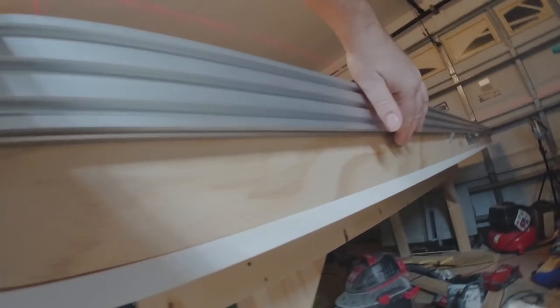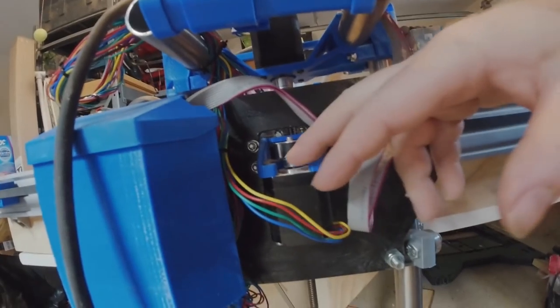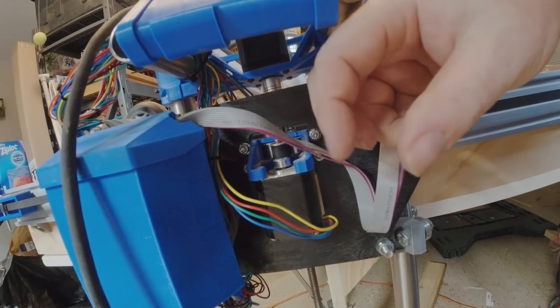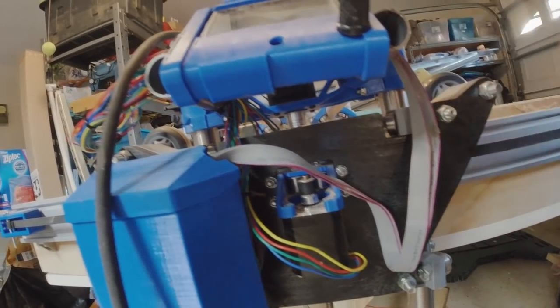Quite a tedious job, but I have these adjustments that I put on there. If you're curious how the CNC works, I'll give you the 1 minute overview, or at least of this one. We've got these stepper motors, and a stepper motor can be computer controlled to move in partial degrees, just moving according to what it's told. That's on this belt, and this belt goes down to the stops that I made, down to the far end, and pulls it along the track. There are two motors synced up exactly the same on the other side to make it move in this axis.